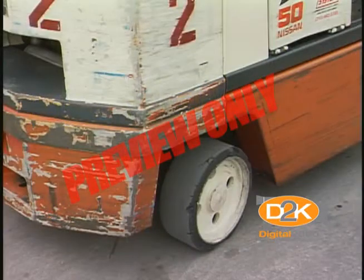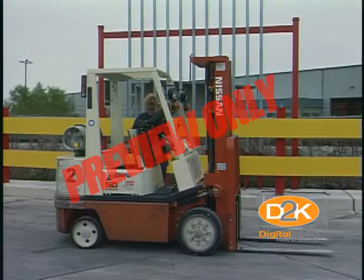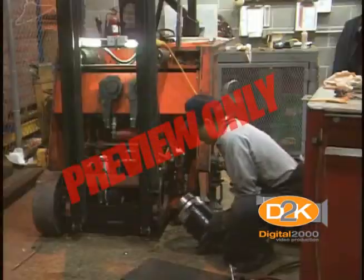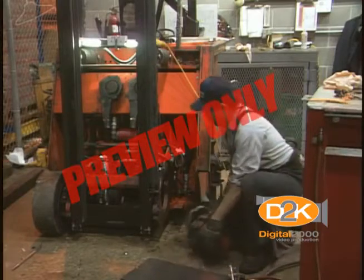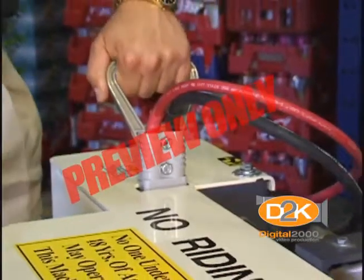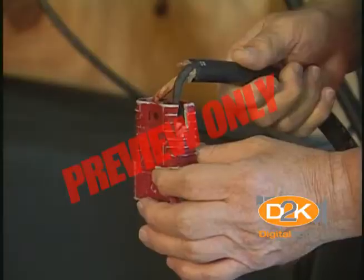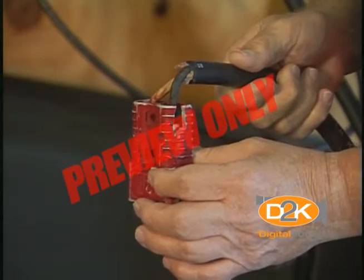Any power-operated industrial truck not in safe operating condition shall be removed from service. All repairs shall be made by authorized personnel. Repairs to the fuel and ignition systems of industrial trucks, which involve fire hazards, shall be conducted only in locations designated for such repairs. Trucks in need of repairs to the electrical system shall have the battery disconnected prior to such repairs. All parts of any such industrial truck requiring replacement shall be replaced only by parts equivalent as to safety with those used in the original design.